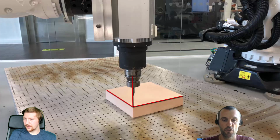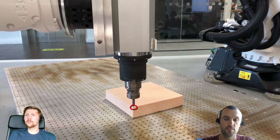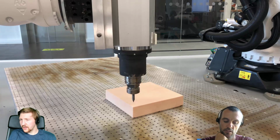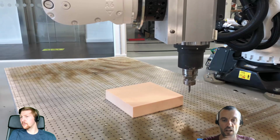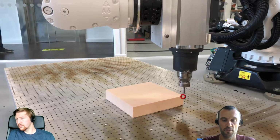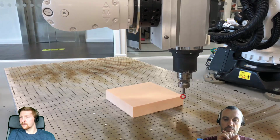So obviously when we post-process from Fusion, we're going to post-process from the corner, the WCS we selected, provided you define the name like you showed us, the number. You post-process and all our coordinates will be relative to that position that we define on the machine. I think we have a few more videos, but the most important things are defined: how to define a coordinate system on the machine and how to make sure your tool is in the right alignment that you need.